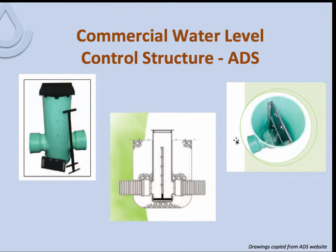There are two main commercial manufacturers of water level control structures. This one is made by Advanced Drainage Systems, or ADS. You can see at the bottom of the picture a baffle that is 6 inches high and about 12 inches wide, with the implement you'd use to insert and remove it. The middle picture shows a stack of baffles where tile are connected before and after the structure — it extends above ground level. The picture on the right shows baffles inserted into a column, with rubber gasket material to keep them sealed and water-tight against the side.